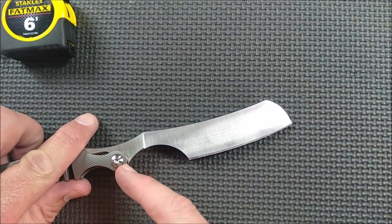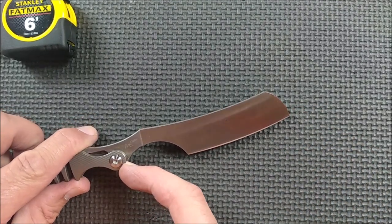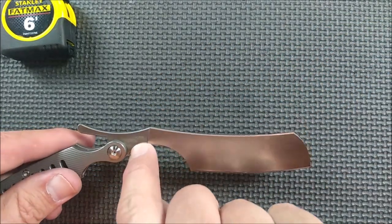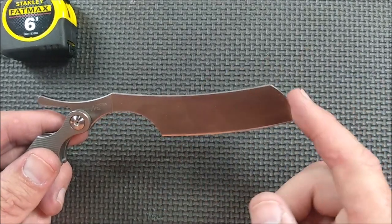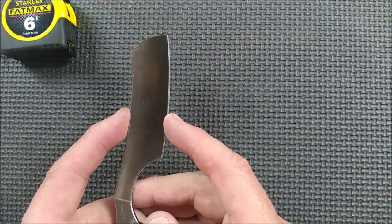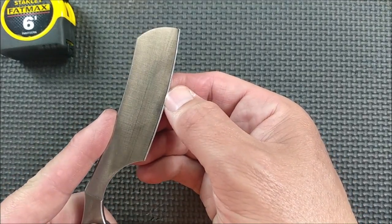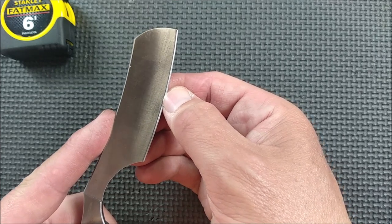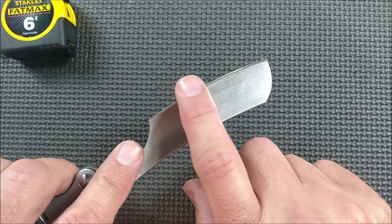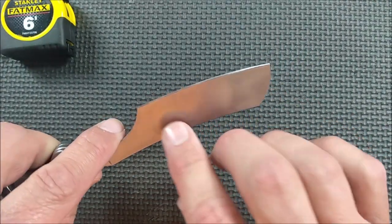For blade length — is it to the plunge right here, or is it to the handle? I measured it from the tip of the blade to the handle: 10.81 centimeters, 4.26 inches. The blade thickness — I measured up here on the tangs — is 3.5 millimeters, which is 0.138, so over an eighth of an inch thick. The blade depth is 2.25 centimeters, 0.885 of an inch. The thickness of the edge behind the grind is 0.51 millimeters, which is 20 thousandths of an inch exactly. The grind angle is 17.5 to 17.7 degrees — very good consistency all the way across. This is one of the best sharpened knives that I've had, and I like that a lot.